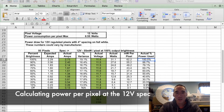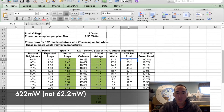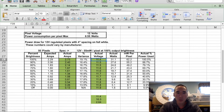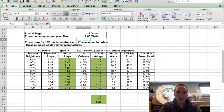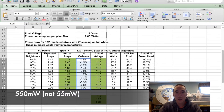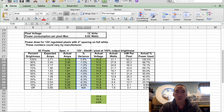Based on the calculations, let's figure out how much power is actually being consumed per pixel. Right here it shows 62.2 milliwatts per pixel, but that's at 11.4 volts. If I look at the spec, our expected current is assuming 12 volts. Let's change that to 0.65 watts or 65 milliwatts. Now we're looking at expected amps that are much closer to the actual amps that were measured, and our variances are close to zero. So for these pixels rated at 55 milliwatts, they're actually 65 milliwatts — about 18% more power consumed than expected.